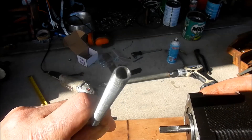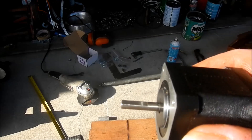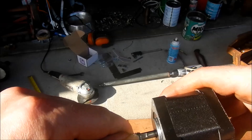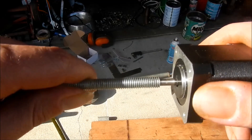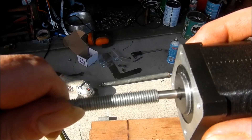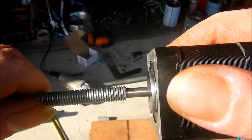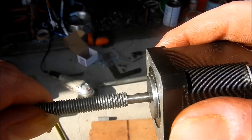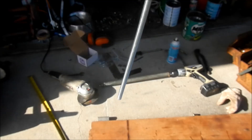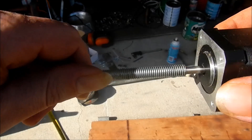I've drilled a hole in the end of my rod and I will be attaching a grub screw for the flat spot on that shaft, possibly with a big nut there to help give it a bit of extra meat for the grub screw. Now this one wasn't ideal — there's a little bit of play there. I think I probably could grub screw it dead centre and I will be trying that before I do it again. But I have left my rod long enough that I can afford to have two or three attempts at this, and I did learn a lot with this one.